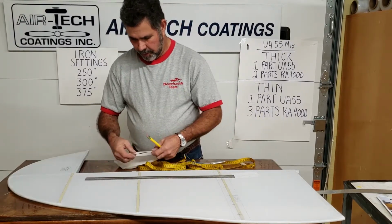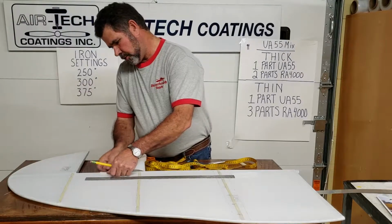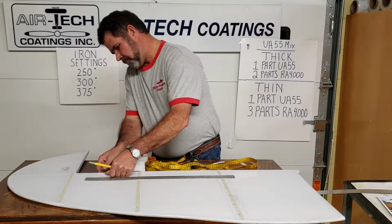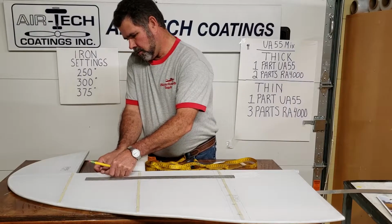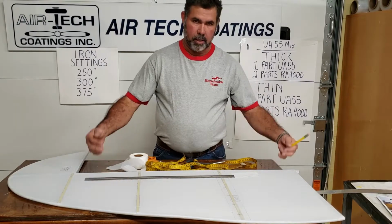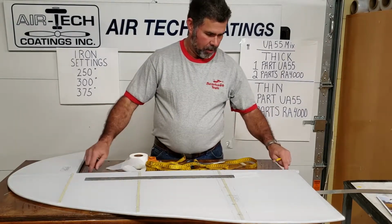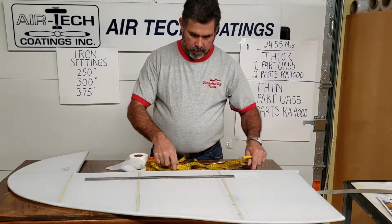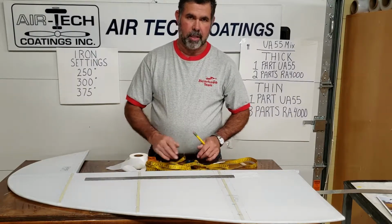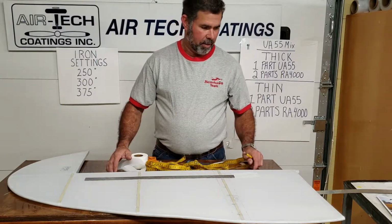The other way people can do it is, say you're just going to use a 2-inch. And let's say you come down here and just eyeball about to the center of the post and put a mark. That way you can put one piece onto the center, the other piece onto the center. That's perfectly fine. You're going to have a double pinked edge in the front, but that's in the hinge point. You really don't see it. You can iron that down smooth and it'll be fine.